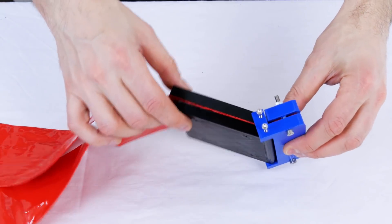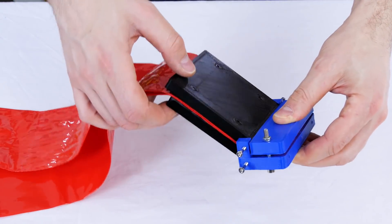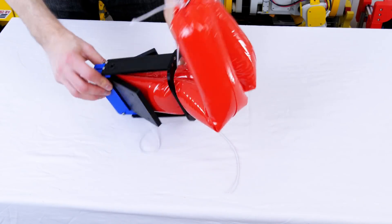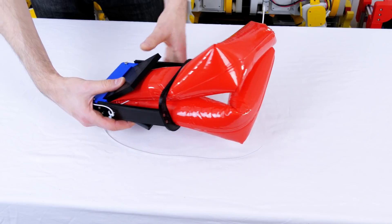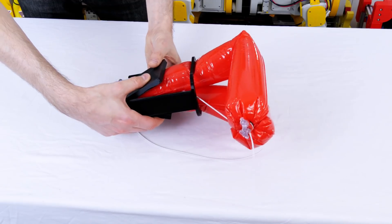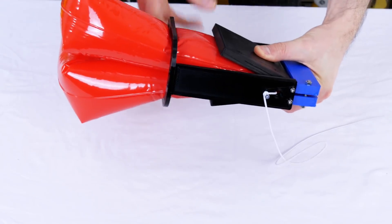One issue I found was that it's quite hard to hold the actuator rigid because the hinges both move in the same place and it squashes the water noodle flat. So I made an additional brace piece that goes all the way around, and that holds the water noodles facing in one direction no matter what happens to the bellows flaps. This seems to make a much better actuator — it's a much better action and it also reliably points in one direction.